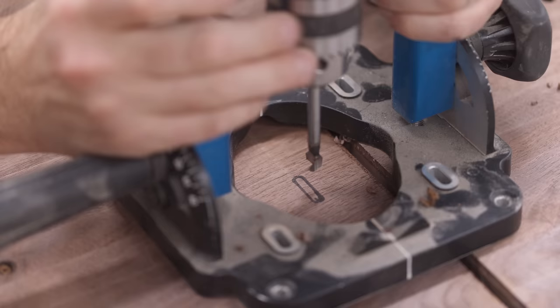I'm almost ready to assemble the tambour cabinet, but before I do I need to square up the ends on these curved parts. The technique of gluing some sandpaper to a flat surface like this piece of plywood is really effective, and just after a couple of minutes I had both of these flattened. After gluing on the sides I can add the back panel, but these ends weren't sitting perfectly 90 degrees to the top, so I scribed the backer board and cut it on the table saw at a slight angle — probably like 88 or 89 degrees — but after sneaking up on the cut the back panel fit nicely and I could glue this all up.